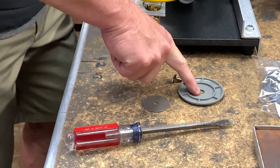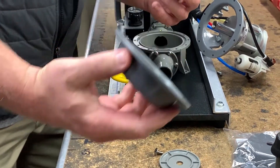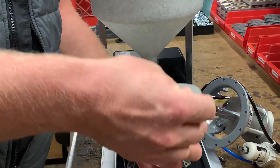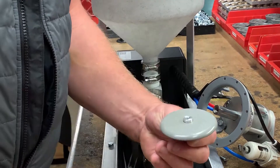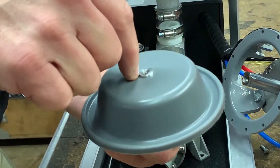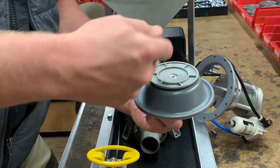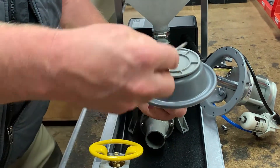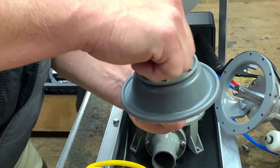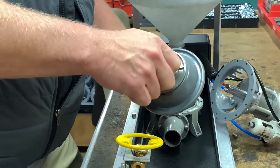Remove the stainless steel washer and plastic button, then take off your diaphragm — theoretically this would be the worn one. There's your washer and plastic button. The diaphragm goes down in position; make sure it goes around the boss, just like we stress on our clevis assemblies for ones and twos. The second button faces up so you can see the bosses in there, then put on your smaller washer.